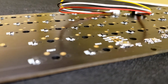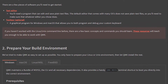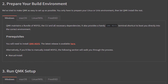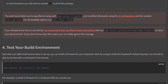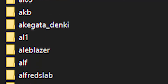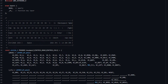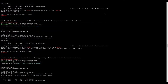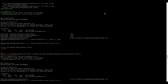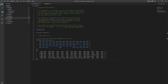With all the components soldered on, we're ready to go, right? Nope — we still have to put firmware on the chip. I'll be using QMK, a popular open source keyboard firmware tool. I mistakenly thought firmware would be one of the easier parts, but many guides teach you how to modify firmware for keyboards that have already been made, not how to write firmware for a new keyboard. You also can't just take someone else's firmware and slap it onto your own keyboard because they could have a different microchip, different pin setup, and countless other variations. So once again, we're back to studying other people's GitHub repositories, but even that wasn't enough to stop me from getting non-stop compile errors. I got really frustrated because I was so close to the end, yet so far — and it turns out all I had to do was press enter at the end of the file.